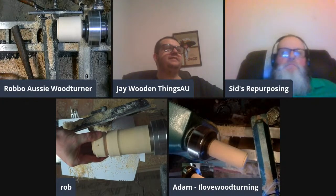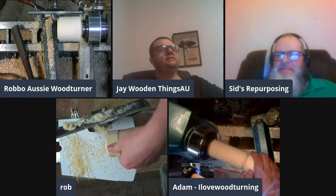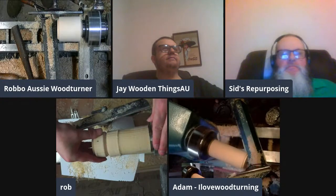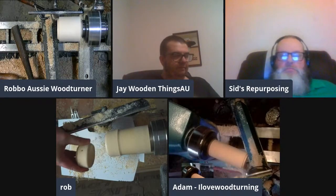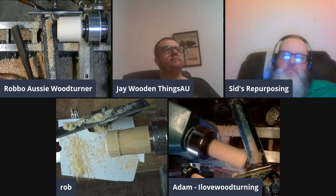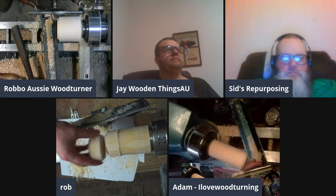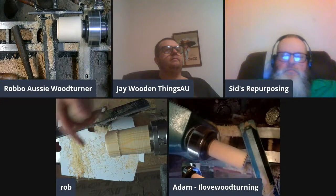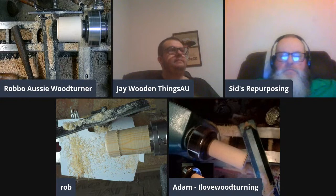What speed have you got your lathe running at, Robbo? Oh, I don't know. Turning speed. Did it fit over the chamfer? No. I had the lathe running, and I pushed this on. But I can't see it. There should be a shiny mark or a little burn line on it. I'll try running the lathe a little bit faster to see if that helps. Yeah, try putting a bit more pressure on it, Rob. But don't put too much because it'll start chattering.